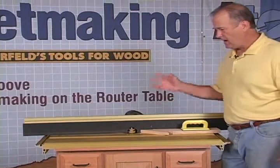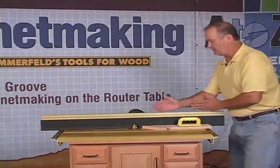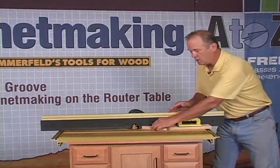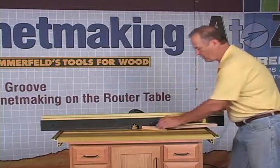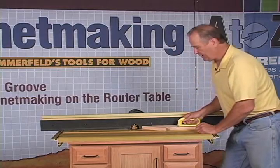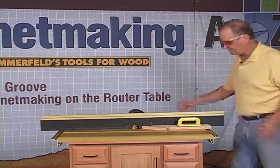Now here's where at the beginning, remember I told you we don't use a miter gauge. Even though our fence is not parallel with this miter track, we never use a miter gauge. I never use one because this backer board coming right behind here, the bearing is our guide. We don't need a miter gauge. So I'll show you how easy it works. We'll come in here and make our two cuts.